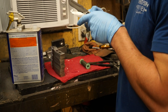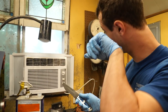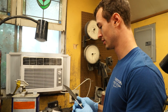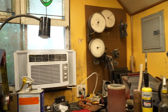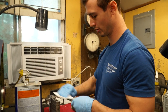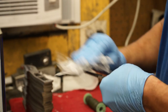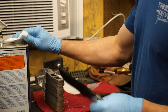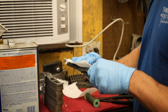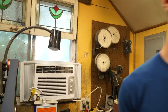From here we can start tumbling if you want to, but to get the look that I want I want a little bit of a darker finish on the blade before I start tumbling — to create a little bit more contrast. The way that I do that is simply go in for another etching cycle. I'll go ahead and degrease this again with some denatured alcohol to get any water or anything else that got on there off.